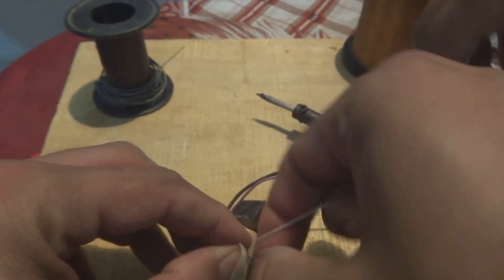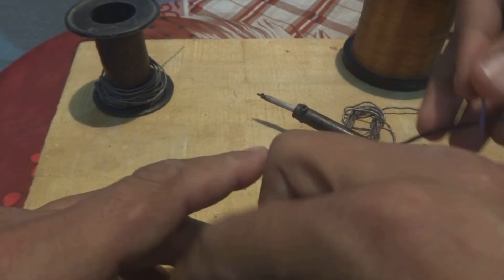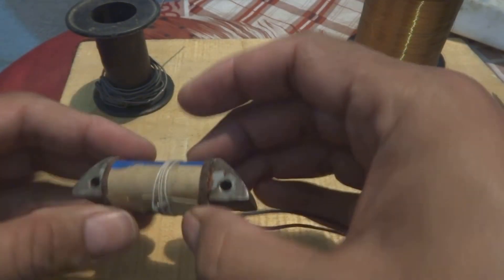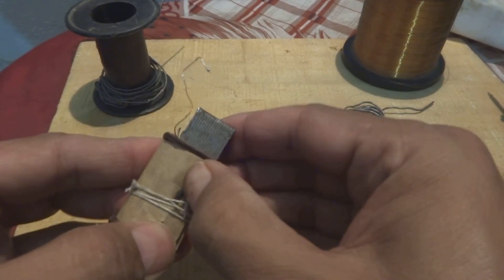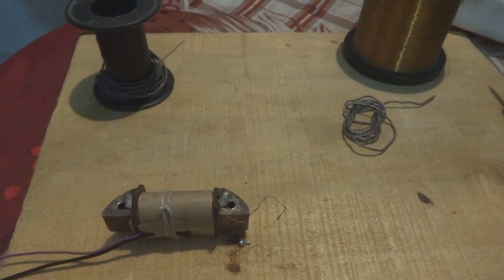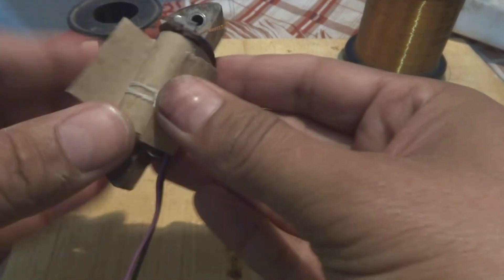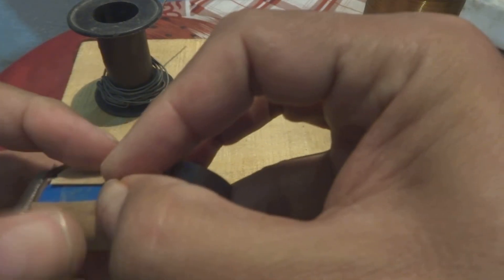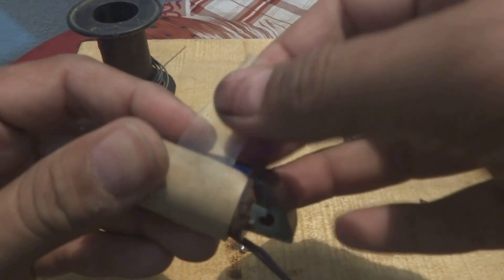This has been completed. But we will wrap one extra turn of the insulation paper to make it further protected. On the top of that we will provide further tape. This is complete — if we do it somewhere like this, it will secure the internal connection of the winding. Further, we will provide a piece of tape to protect it. With a piece of tape I just protected this winding — this insulation paper on the top of the winding. Again, another piece of tape I am providing for further security.